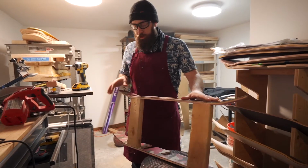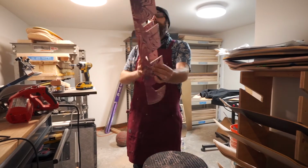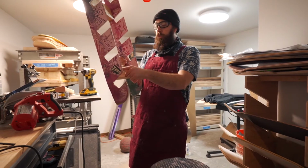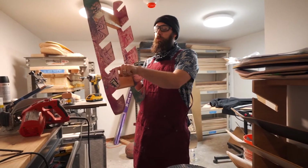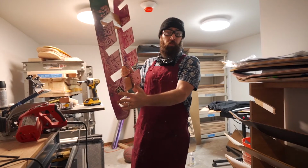So once we've got our 2x4s holding both sides of our board rack together, we're almost done. The last few things we want to do is get it ready to hang on the wall. So we're going to punch two pilot holes and we're going to go ahead and countersink them so that our screws sit flush. And then we're going to use a little bit of 3M foam to wrap the inside edges to make sure that we're not damaging our boards while we store them on it.